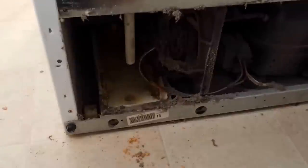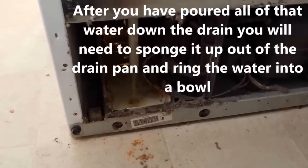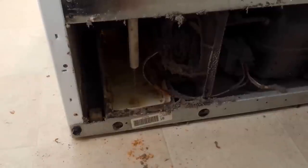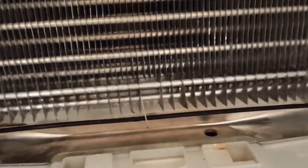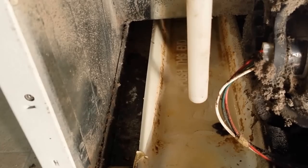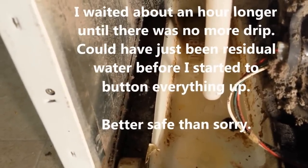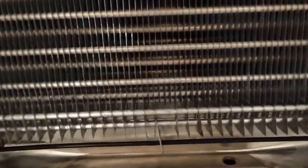That was a really good sound. I just poured more hot water into the top of that drain — look what I've got going on down here. I ran two more quarts of hot water down that drain and I see a slow drip coming out of that drain tube. I'll tell you what that says to me: there's still ice in there. If that's the case, I'm going to wait — I'm not going to close everything up until there's no more water dripping down.